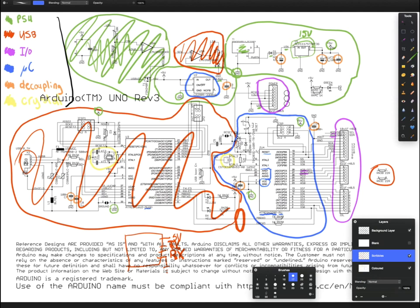So the reset is connected to this resistor here. And this is a really important concept to understand, and it's the concept of pull-up resistors. Now, using Thevenin equivalent circuits, we can pretend that the reset line is actually a resistor to ground. I can tell you that because of the way this works, it needs to be big, like really big. We're talking like, I'm going to guess 500K. So that's quite large. And here you can see we have a 10K resistor. So we have a 10K and then we connect to 5 volts. So we'll put 5 volts here.